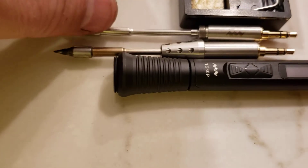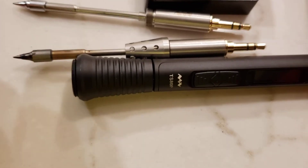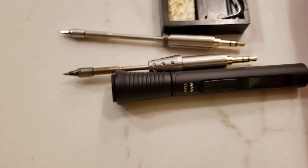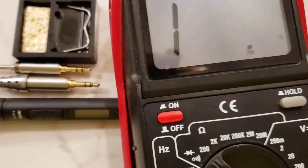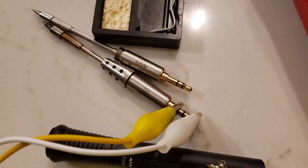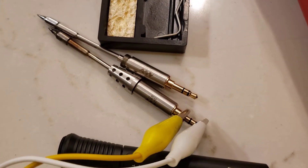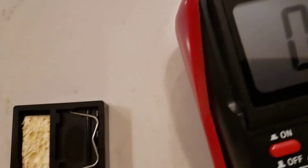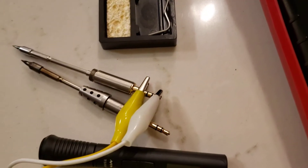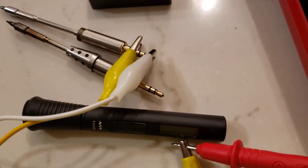I ordered a new tip and was still seeing issues, so I figured out what was going on and decided to make a video about it. Using an ohmmeter with clipped wires, the older tip measures about 6 ohms and the newer one also measures around 6 ohms — they're identical. So there must be something in the black base unit that's not working correctly.